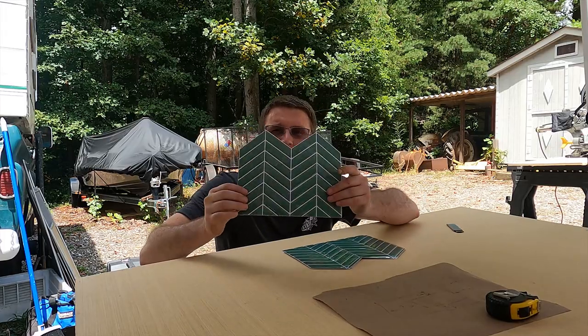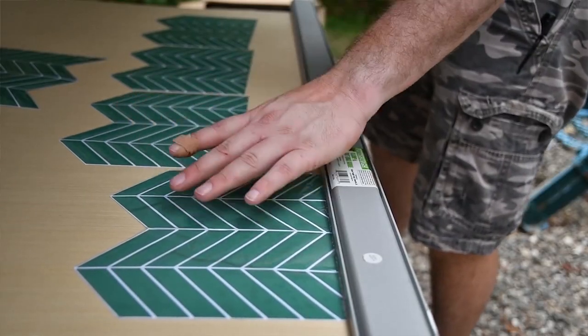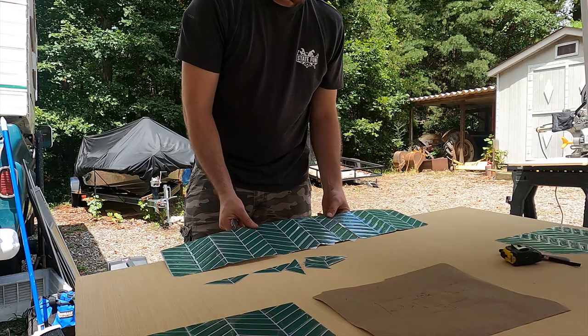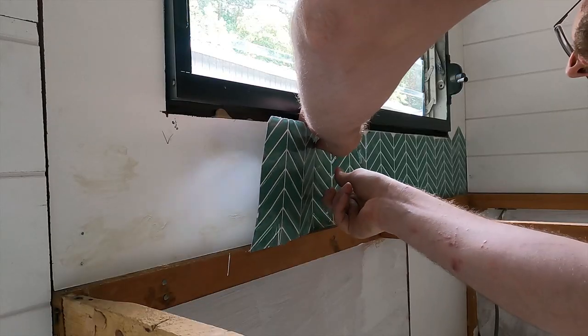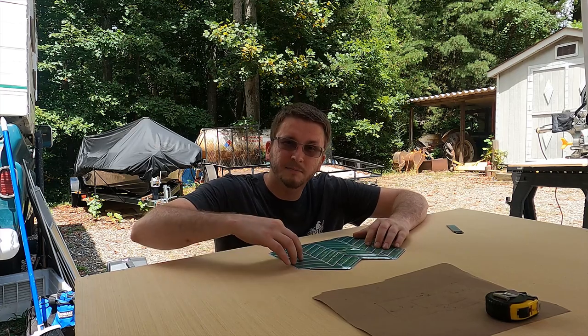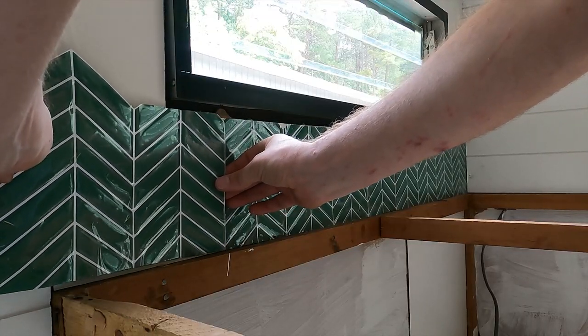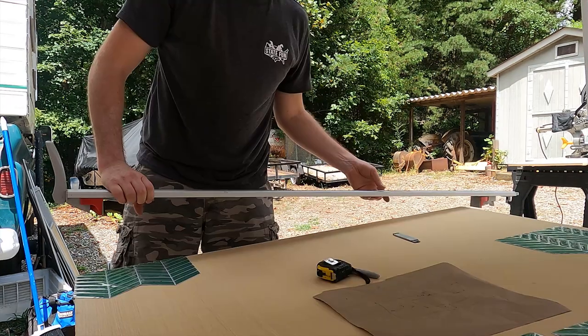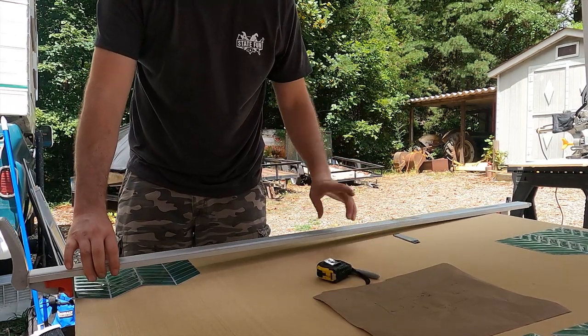I took these, stuck them across the bottom, put the clamp across them and cut them nice and flat — that worked out really well. I'm gonna do the same thing to the three that are going under the window. I'm gonna cut them out to six and a half inches tall and then do the side pieces at the measurements for five and six inches on either side. So we've got our two sides and three for our middle. We'll measure this out, clamp it down, cut it out.